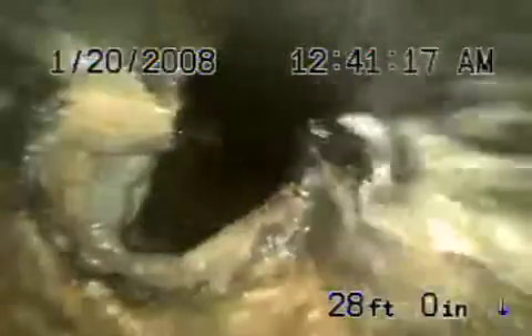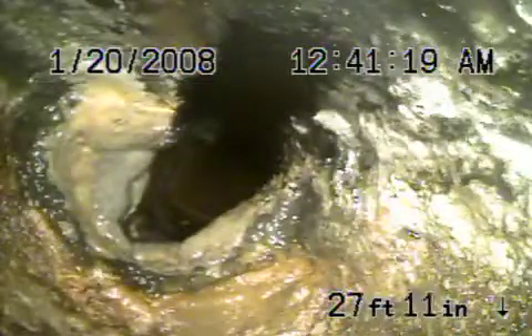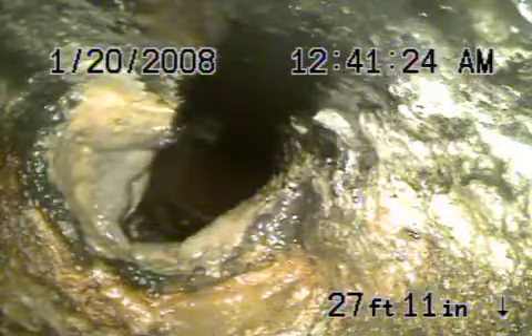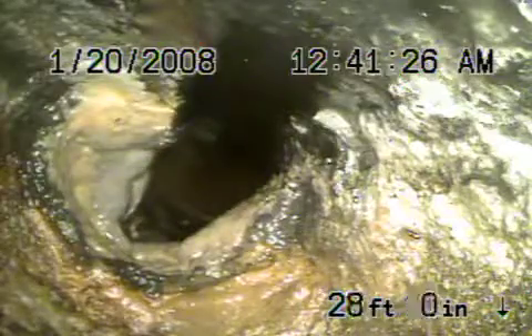Let's keep coming back. You can see the accumulation of a little bit of sludge there. Do you know how old the pipe is? This is the original pipe of the house. They replaced the pipe outside — I'll show you what they're replacing. You can see the cast iron pipe underneath the house does have some sludge buildup — that's where the kitchen connects. You can see it's a little greasy right there at the kitchen connection, but this can all be cleaned out with the hydro jet.